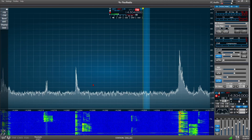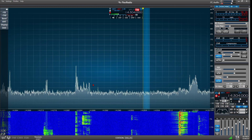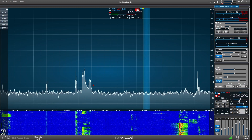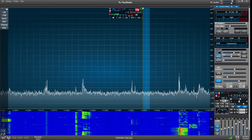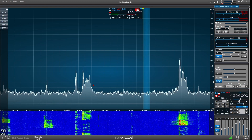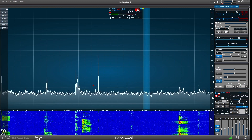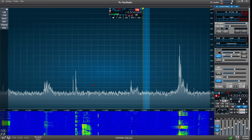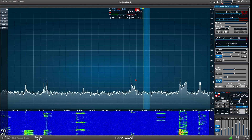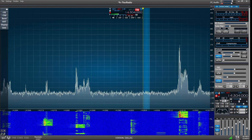So what we've got here is the main screen — the main program to drive the Flex radio. There are three programs we can use with the Flex: Smart Cat, which interfaces with this program to do CAT control; Smart DAX, which is a digital audio interface used with something like WSJT-X to pipe audio over the network; and the main Smart SDR. This up here in the top center is our slice and the settings for the particular slice we're on. I only have one slice running right now.